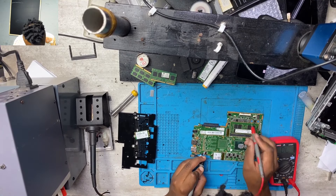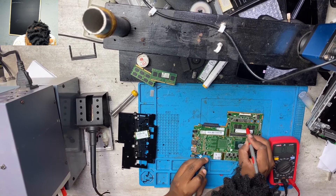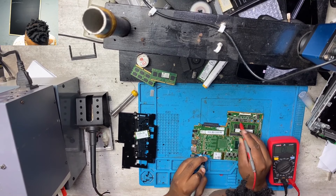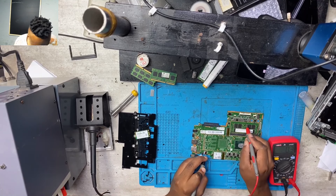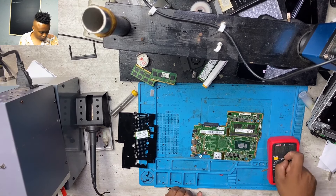As you can see, my hands — one is far away from the other — I was checking how the power flows. I caught how the power flows and the multimeter was beeping, giving me 0.5 ohms, which means there was a connection from the charging port into the first mosfet.